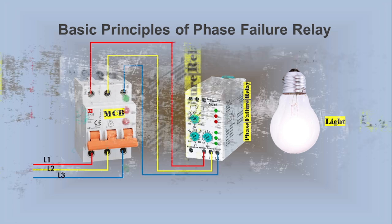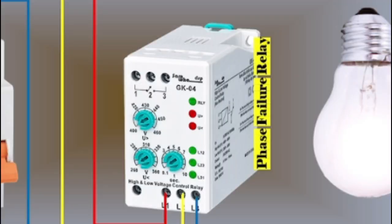At the top of the relay, you'll notice three more terminals labeled 1, 2, and 3. Terminal 2 is the common terminal. Terminal 3 is normally closed to Terminal 2. Terminal 1 is normally open to Terminal 2. All these terminals maintain their designated states under normal conditions.